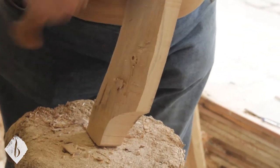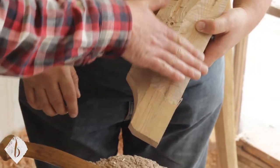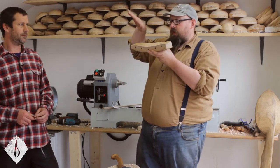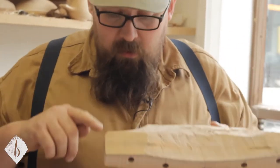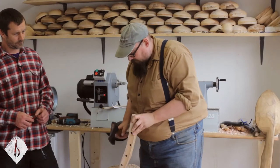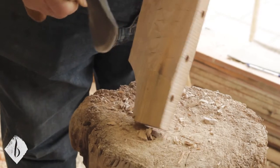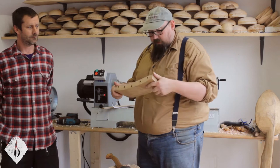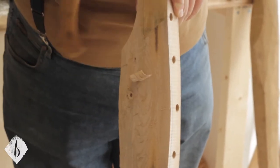How do we shape this bit? It's nice to have that coming off there — this part leans back and that part dips in and they blend here. Because we're trying to get as much curve out of it for the spindles, we've got a bit of a flat here. If I can curve this as much as I can, you won't notice that flat so much. On the finished chair you barely notice that — we just blend that in with very fine tools. It's still a fair chunky bit of wood, still plenty of material to come off, but now's the time to move to a draw knife.